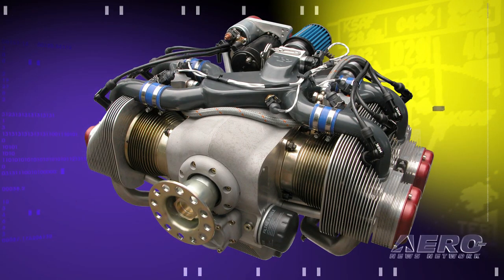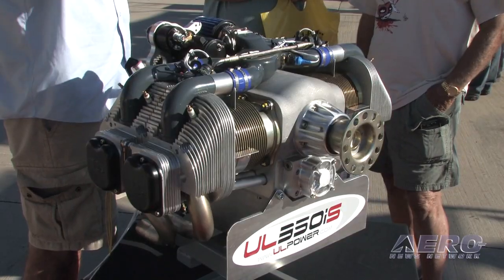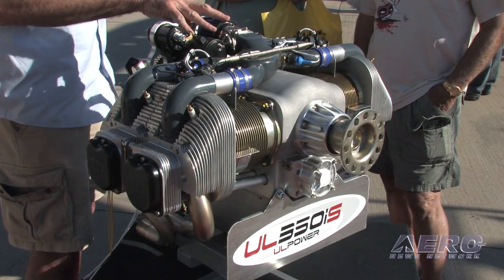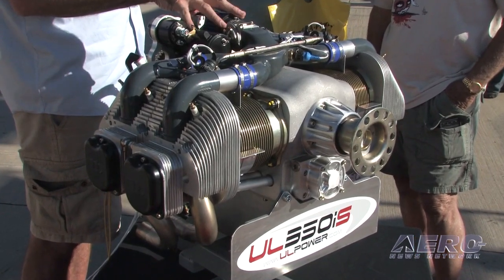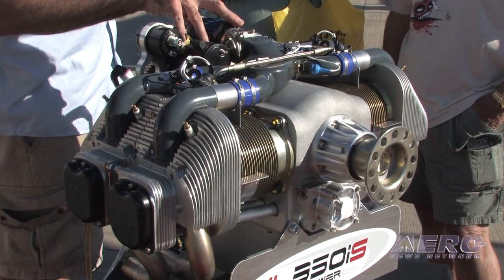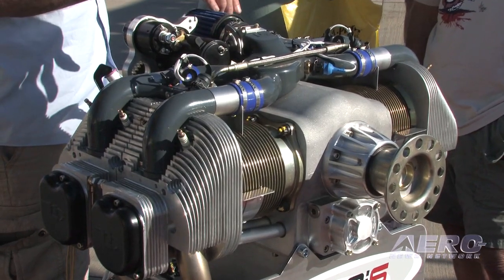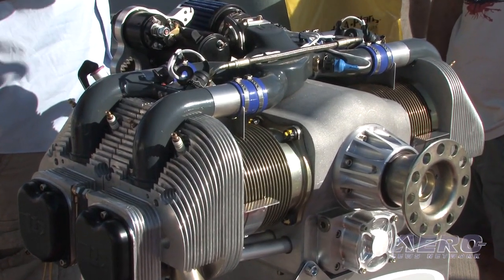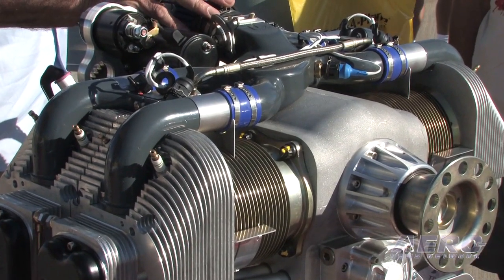The first engine shipped about six years ago. What's unique about this engine is it's an all-new design, but it's an aircraft engine — designed on purpose as an aircraft engine. It's direct drive, air-cooled, four-cylinder horizontally opposed. It's basically like the traditional aviation engines, the O200 or the Lycoming, but built with CAD-CAM technology, new lightweight materials. We're basically 30 horsepower more than the O200, but we're 80 pounds lighter.